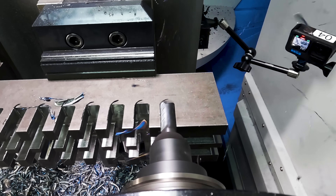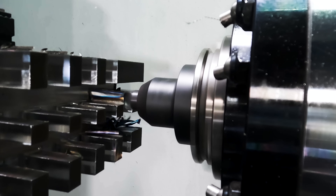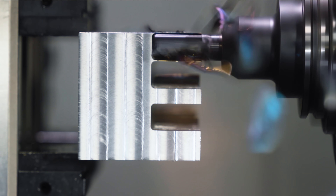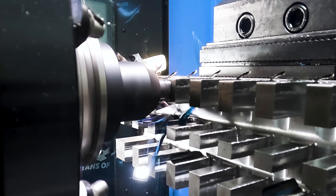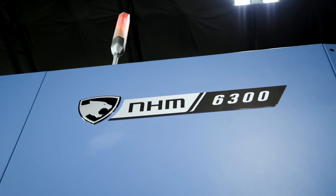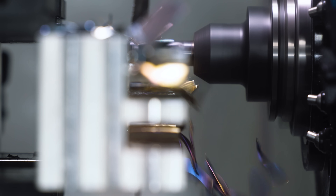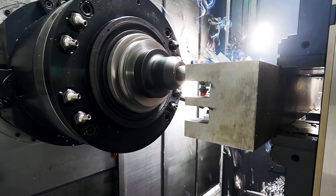When we make cuts like this that blow your mind, it's so that you will open your mind. And when people say, oh, that's gonna break your spindle or ruin your part or ruin your cutter — no, it won't. We calculate every little thing about these cuts. We know exactly what our spindle can take, what our fixturing can take, and what this cutter can take. This cut is barely scratching 100% spindle load, and this machine is capable of five minute bursts at 200% spindle. We aren't saying you should run like this — we're running without cooling. With coolant, we would have had the added lubricity and chip evacuation, and this cutter would have easily lasted all day. If we can do full slots like this at two times D depth with no coolant, maybe you guys can go a half times D or one times D, increase your feed rates from two inches a minute to 10, and then you guys will start making some money out there.